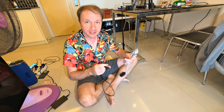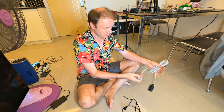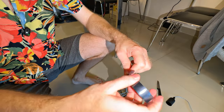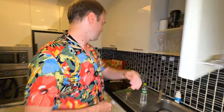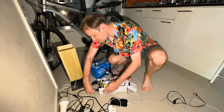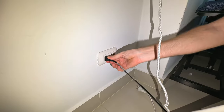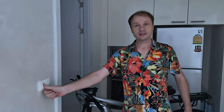In order to power the whole house from the uninterruptible power supply, we need a special cord — a male-to-male plug cord. We take a wire from an old soldering iron and one from a lamp, cut and rewire phase to phase and zero to zero. Now we need to turn off our house on the input circuit breaker — this is mandatory so that electricity does not go to the neighbors. The electricity is off. We insert one plug into the uninterruptible power supply and the second plug into any outlet in the apartment. Then we turn on the uninterruptible power supply and electricity will disperse throughout the apartment. You can simply turn the switch on and off to use electricity throughout the apartment.